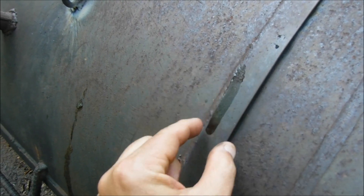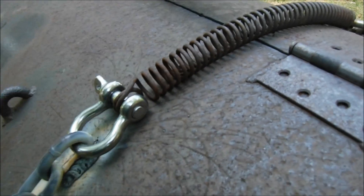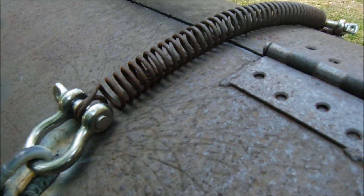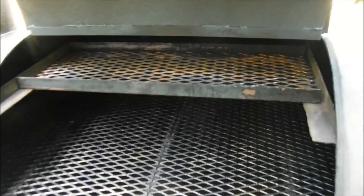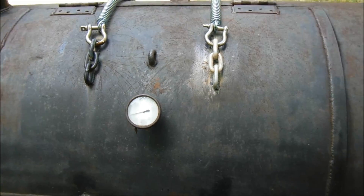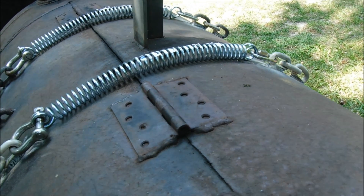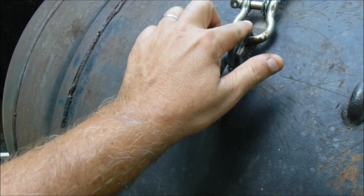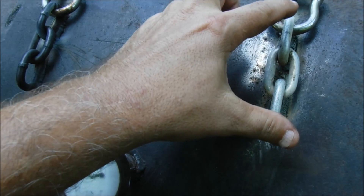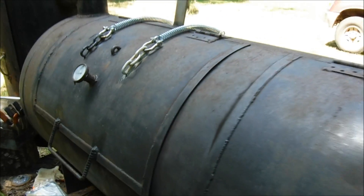This is a one-inch flat bar right here to seal the cut up. One-third the distance, one-third the distance, one-third the distance. And then the local hardware store — local Lowe's — sells these springs right here. This spring has been on there for about 10 years. After about six or seven years it started to lose its strength pretty good — it still assists just a little bit. But this is what I had in mind. We've got two springs with two stainless steel shackles on it. I've got 800-pound rating on those rings back there, but I'd like to replace those with stainless steel shackles — they were out of shackles. Whenever I first built this pit 10 years ago, all I did was put this one set of link chain on here, but I had it planned to be able to go in with another set. So you've got one-third, one-third, one-third the distance — symmetrical.